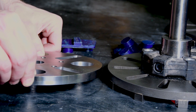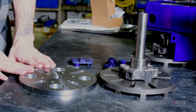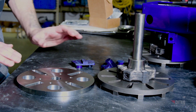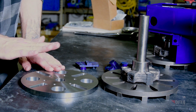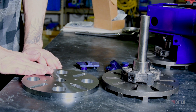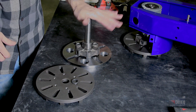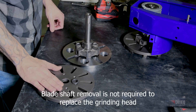If you level your head to the bare plate and then put diamonds on, it will ride at a funny angle. So make sure whatever tooling you're going to use — whether it's tech lock, whatever beads — put those tools on there, use new ones, level your head that way, and you'll be good to go. Every time you replace tools it will work nice and smooth.